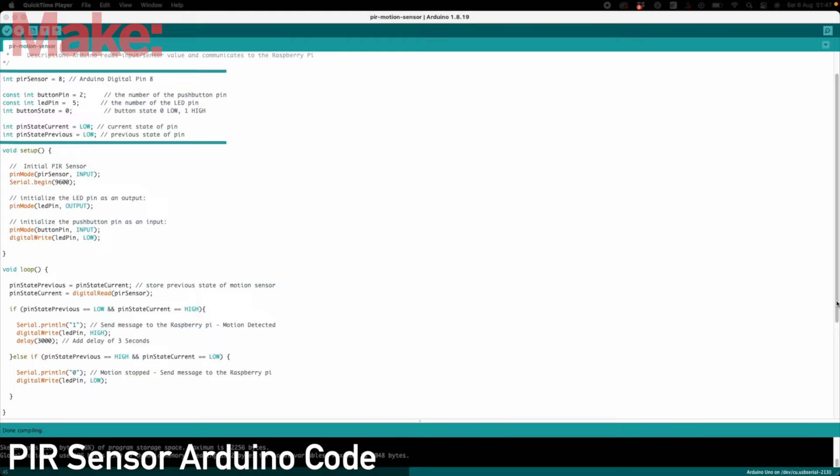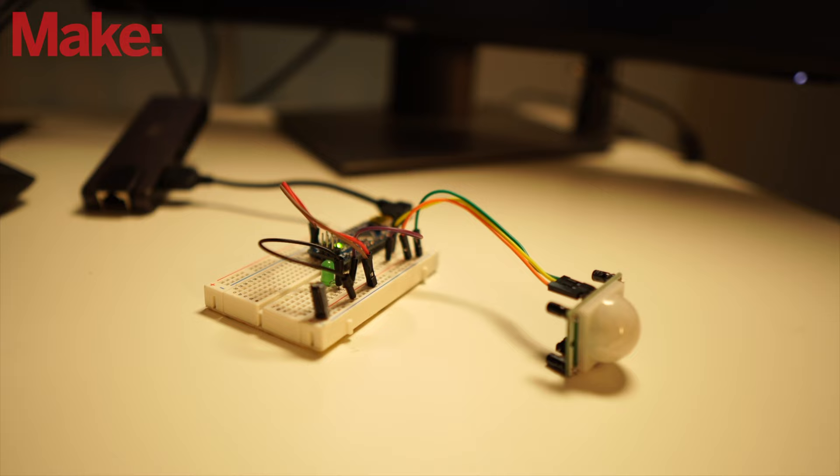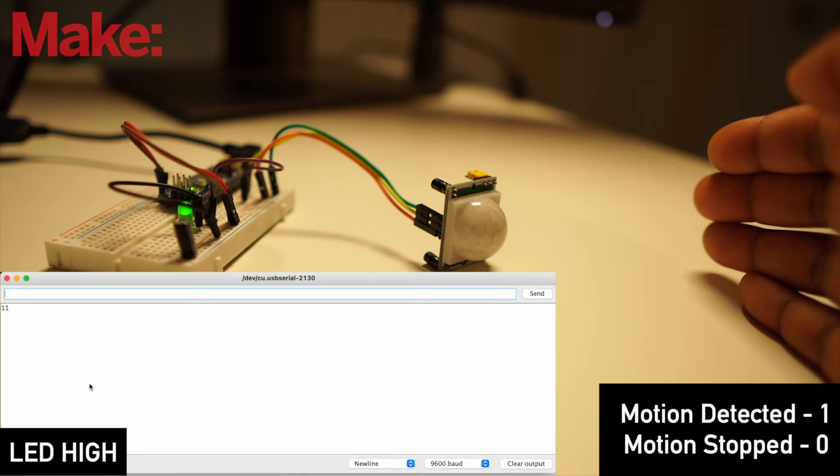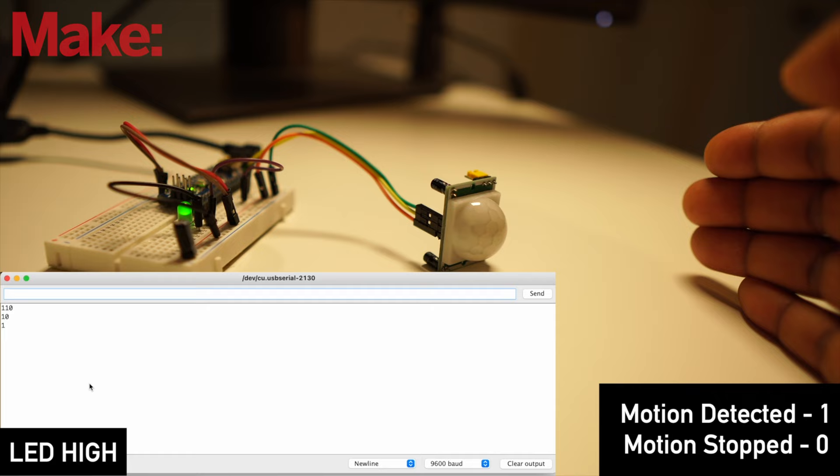In a nutshell, the Arduino reads the input readings coming from the PIR sensor on Digital Pin 8. In the setup, we'll configure the pins making Pin 8 an input to read data. The loop runs consecutively during the Arduino's runtime, where in the loop, if the PIR sensor detects motion — i.e. the current state is different from the previous state — we'll write the value of 1 to the serial, whereby the value of 1 represents motion detected. Once uploaded, we can verify we're all set up by viewing the serial monitor. You should be able to hover your hands in front of the sensor and view the value of 1 appearing on the monitor, whereby your movements represent motion detected.